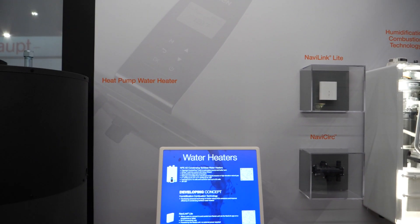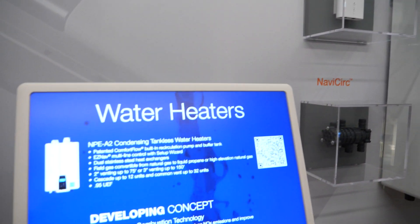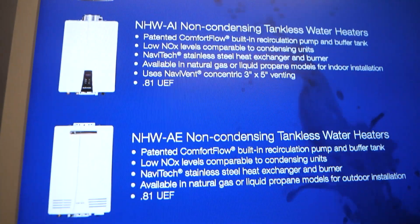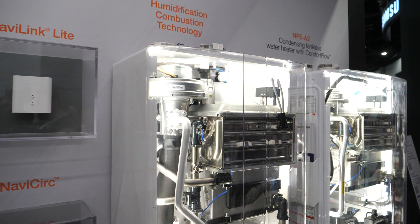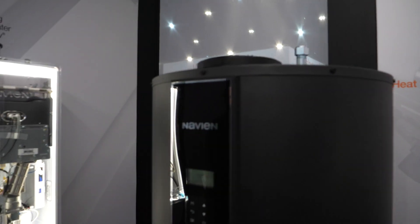When this comes out, there will actually be three different versions available: a builder series, a pro series, and a more premium option as well, with slightly different features between the units. We're going to have it in two sizes — both a 65 and an 80 gallon capability. You can duct it or non-duct it depending on where you're installing. Certainly if you look at places like California and anywhere in Canada, we have that 2050 mandate to get away from gas. Having a heat pump water heater product makes a lot of sense — a lot of technologies are going the heat pump way.